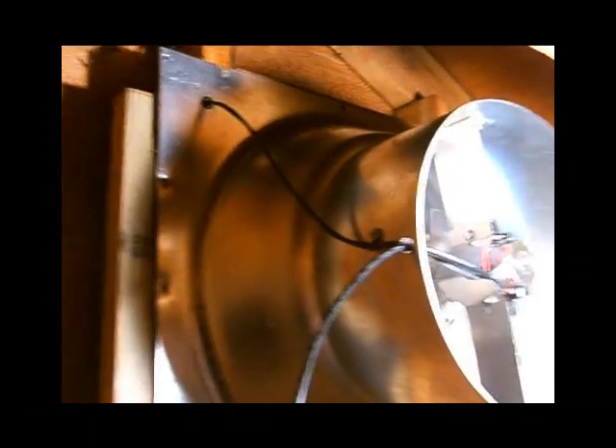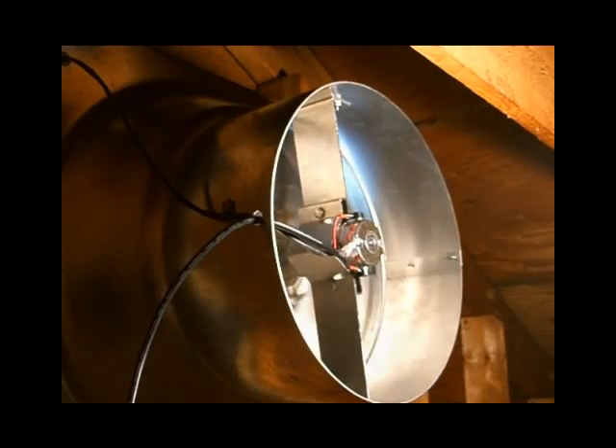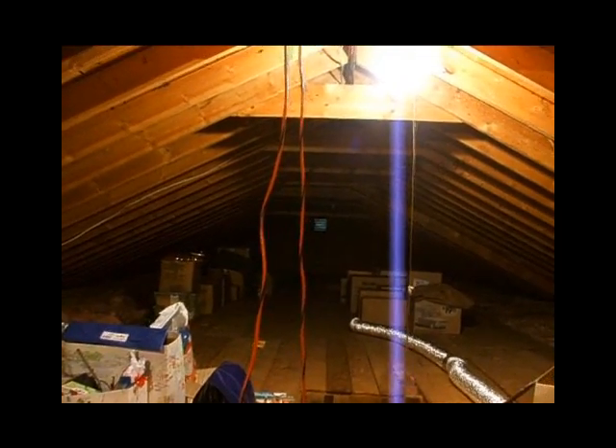Don't make live connections on larger systems where there are higher voltage and current values — results could be lethal. Solar attic fans use only 10 or 20-watt modules, so lethal current is unlikely. Still, the best practice is to cover the module first, make the final electrical connection, then remove the cover.